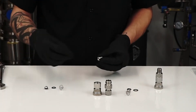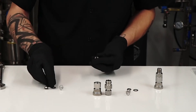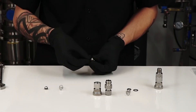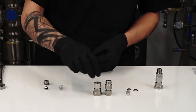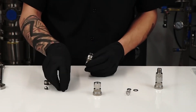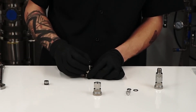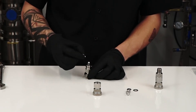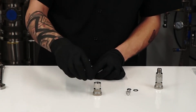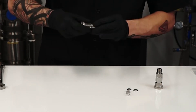Take the large O-ring from the new pack and put it on the outside of the sleeve. Take the medium-sized O-ring from the new pack and put it on the inside of the sleeve where there's the seat. Then take the male housing, put the spring inside of the male housing, taking the cone stopper and putting it cone face up. Take the sleeve, putting the cone face to match the cone face, then take the female housing, place it over that, and hand tighten them together.